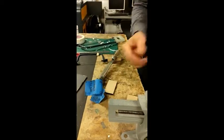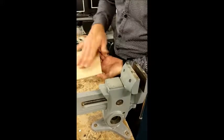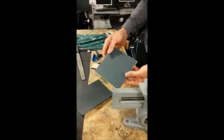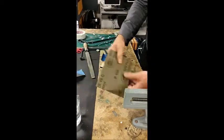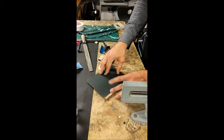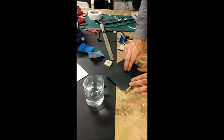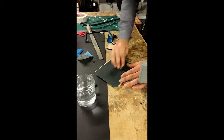The front and back of the piece is a little bit trickier because I can't hold it in the vice very well. What I'd recommend is getting a block of scrap wood — perhaps MDF or hardboard — and attaching some wet and dry paper to it, effectively making a sanding block. This is quite a good casting but I'm going to start off with a rough grade — P120. I'll imagine I've attached the paper to the board. Even using the paper sheet on a flat surface can work, but you'll tend to use less material if you keep these as tools in your tool kit. I'm going to add a little bit of water to keep it lubricated and create that slurry, then hold my pewter piece and work backwards and forwards.